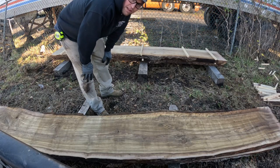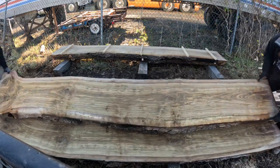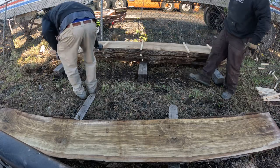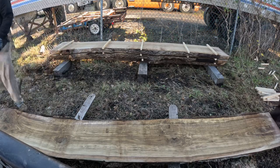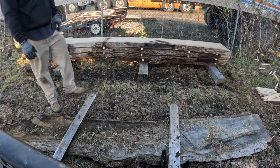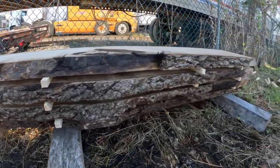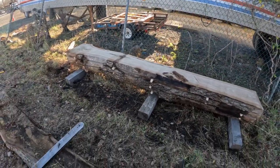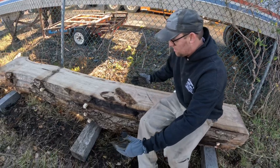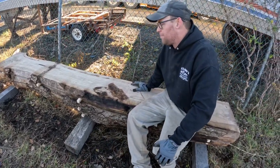As you can tell, we put the stickers over top of the other stickers. That's pretty much how you do it. Sometimes when we're doing dimensional lumber, we'll stack multiple pieces across the width and use the same sticker to go all the way across the width of many pieces.